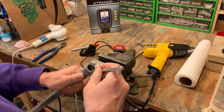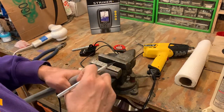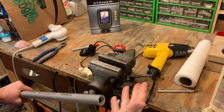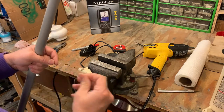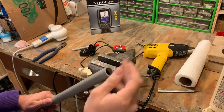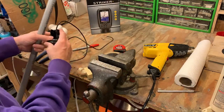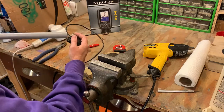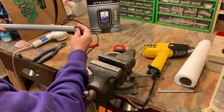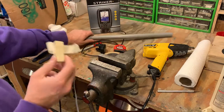The first thing I want to do is get rid of any sharp edges on the pipe, since the wire is going to go up through there — I want it to be smooth and clean. Now I'm going to heat this up a little bit and squish it down so that it fits in between the transducer housing. Right now it doesn't quite fit, but ideally I want to telescope this unit right up inside the kayak.